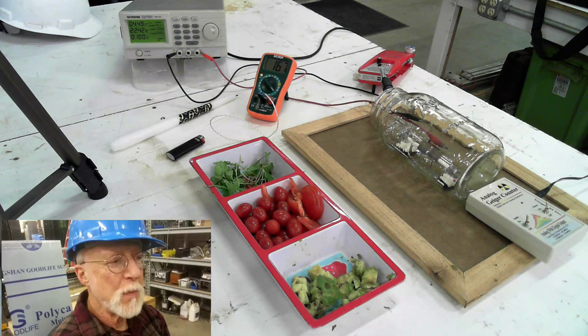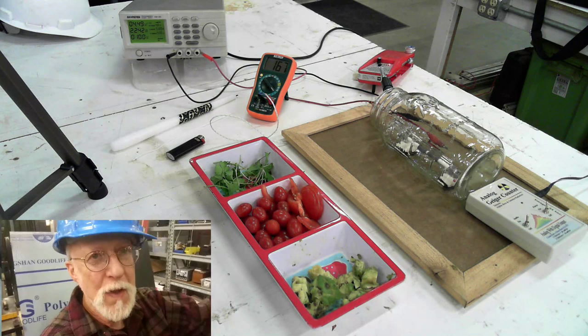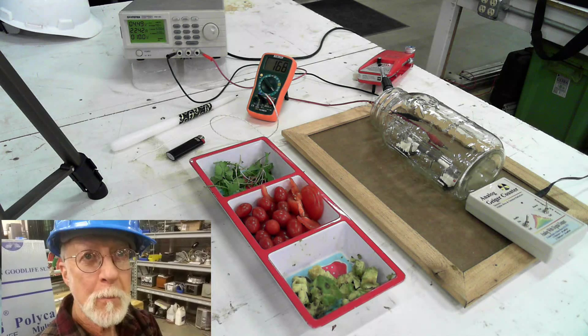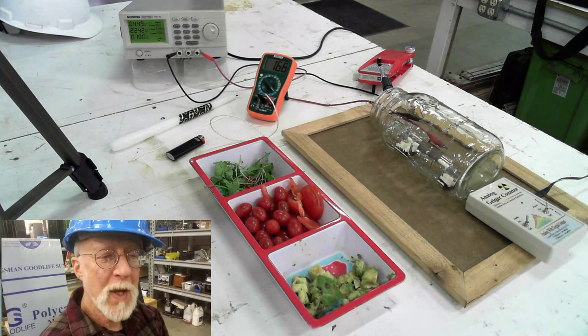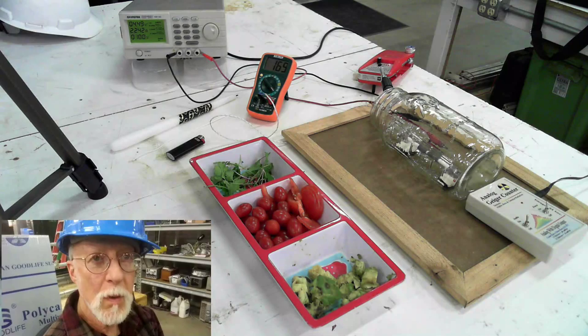And that convinced me that the wedging effect of these fittings and the pressure welding creates a joint that's basically unbreakable. You'd have to physically pull the ceramic apart in order to break that joint loose, unless you loosen the nut. And you got the alumina ceramic from where? These are rods from McMaster-Carr. I don't know who made them for McMaster-Carr, who are distributors, but they're 99.5 alumina, which is a very pure grade. It's not the ultimate grade, but it's very strong.